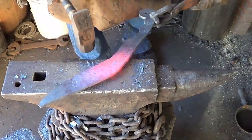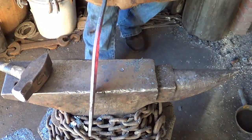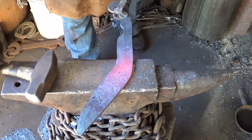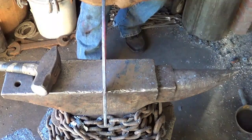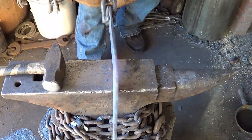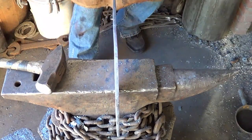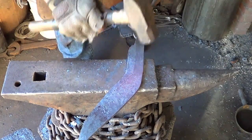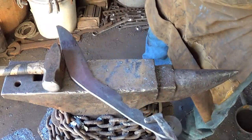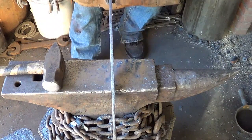Willy Wonka again, but I didn't like that angle much better, so we'll take the time. It's just like quenching, guys. You pull that knife out of the quench and there's a warp on it. Yeah, it depends on where you are in temperature. You may be able to get over to the vise quick enough and put a straighten on it, or whatever it is that you choose to do. But sometimes you just have to say, nope, let's do it again.